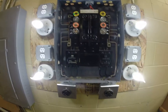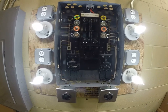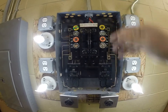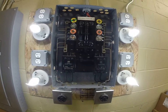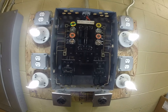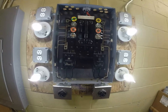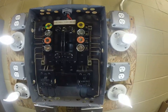This panel is live and I have a service here that's three-phase 208, so don't be swayed by any voltage writings on here. I'm in a lab setting, not a residential setting, so my service is three-phase 208 and I'm feeding this with single-phase 208 to represent a 240/120 volt panel. I did want to show you, it's a nice display of neat and workmanlike manner — even an old panel can look really nice.